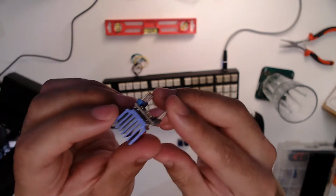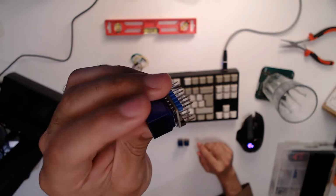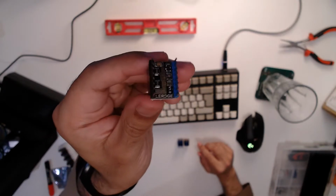These are stepper motor drivers, and what they do is they basically take the electrical signals in terms of direction and speed and all those kinds of things, and they turn that into movement of the actual motors. They do a lot of calculations in terms of microsteps, essentially telling the motor to hold positions between its full steps. Stepper motors turn in 1.8 or 0.9 degree steps, but then you can do what's called microstepping in between that, where you partially magnetize magnets inside the motor, I guess, to make them hold position between the full steps.